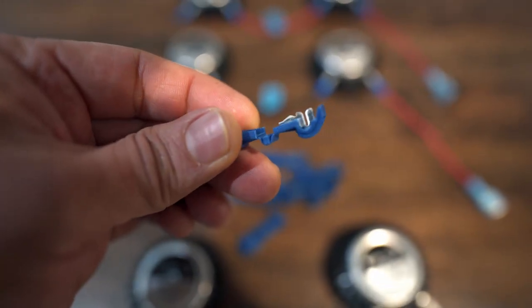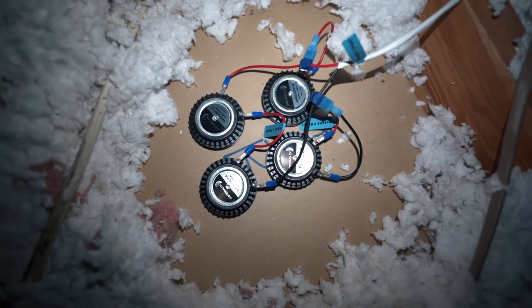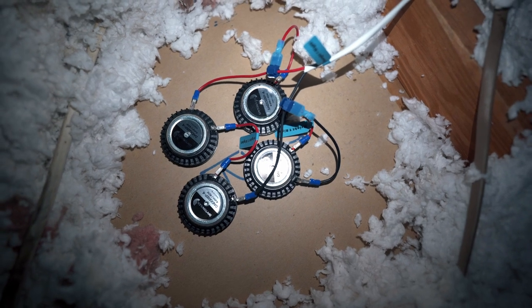I also bought some T-tap terminals to connect the additional pair to the main wires. Here's one channel to show what it looked like. I tested them out, and on the first front channel, I realized by touching them that two of the exciters weren't working. That's not good. The second front channel was doing the same thing, so I started to wonder if the T-taps were not the best thing, because in both cases, it was the exciters tapped in to the main channel.